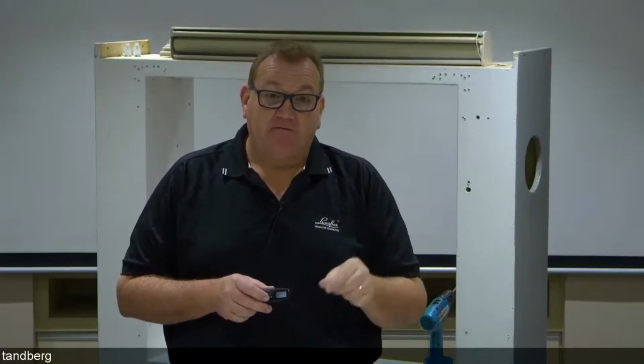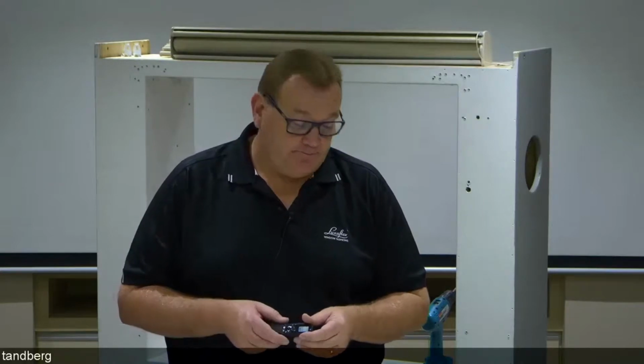Obviously, if you're in corners and bays, be mindful that for traditional and tailored, we have a reasonably large head box. You will end up with reasonable light gaps. Be conscious of that, and the deductions you need to make for corners and bays are per the manual or as per the pricing app.